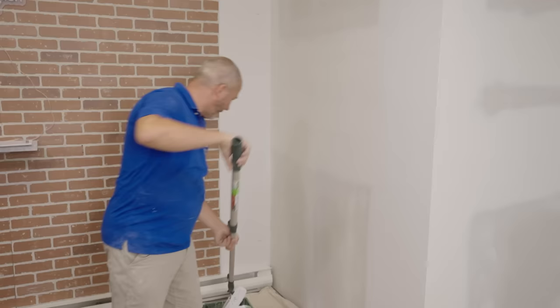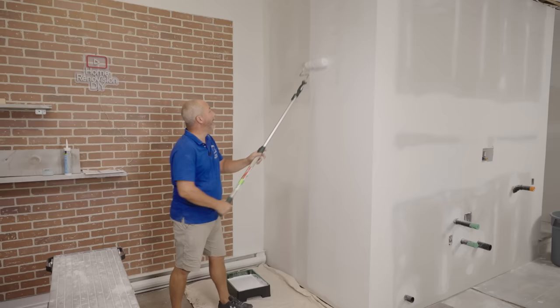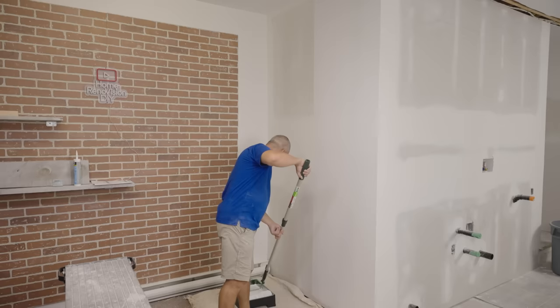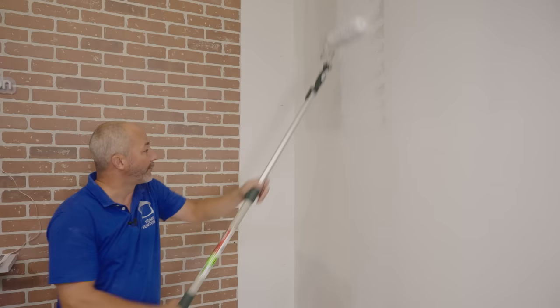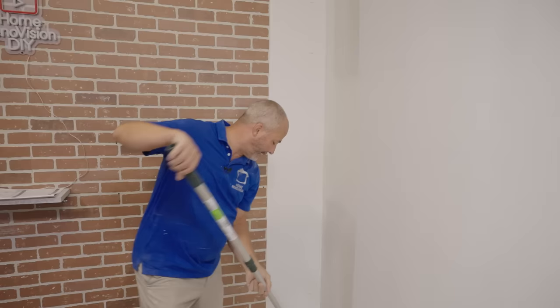When you prime, you always prime first and then you cut. You don't want to waste your time doing a really nice cut because chances are you're only going to need like 2 inches. But you want to use the brush to finalize everything that didn't get sealed. I like to roll first when I'm in a hurry because that way the paint from the roller has time to dry. And then I can do my cutting and then the wall is usually dry enough that I can get my first sanding coat. Don't forget, we're gonna prime and then sand and then paint and then sand and then, oh my God, paint again. Here we go. Of course, if you're not familiar with my rules for painting, use the cage.